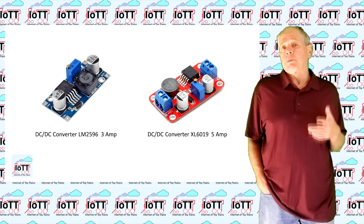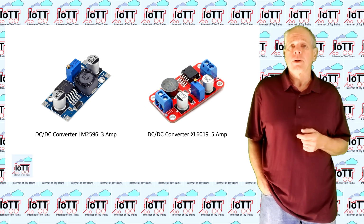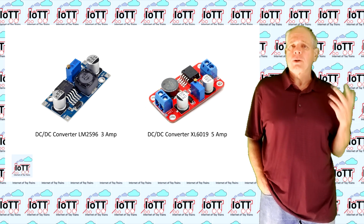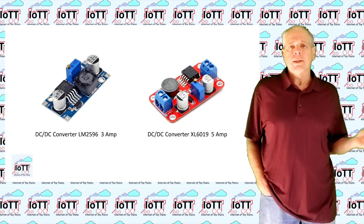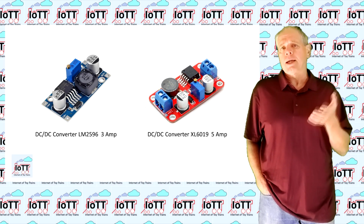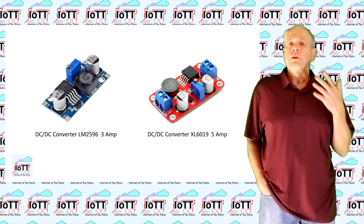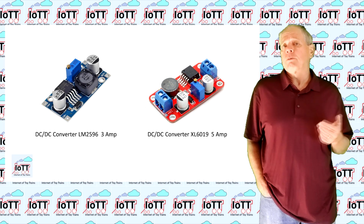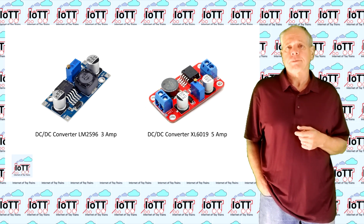The problem with that approach is that all DC-DC converters I have tested so far pretty much limit the short circuit current, as their internal protection function works quite fast. As a result, the DC-DC converter shuts down, or even worse, reduces the output voltage before the command station detects a short circuit, and current might flow through the shorted part for a longer period of time.